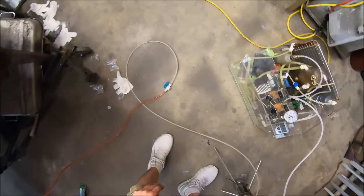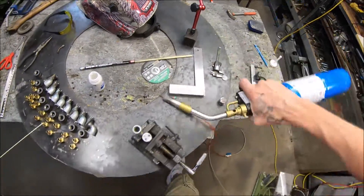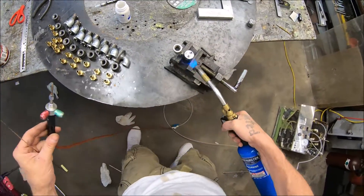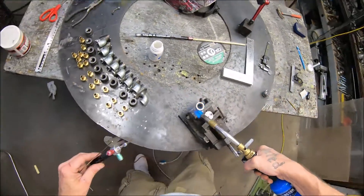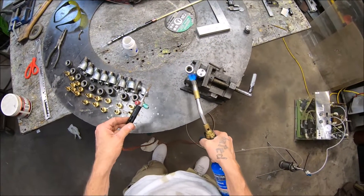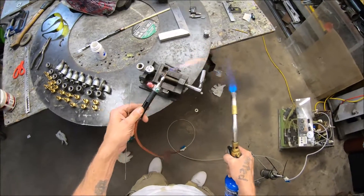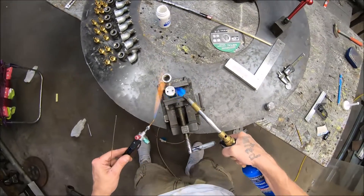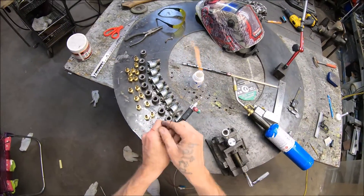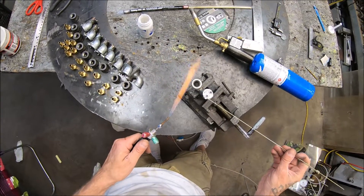I like to let that flow. I'm also going to preheat the base metal here with a propane torch — this thing's going to soak up a lot of heat. Crap, I don't have enough flux — bad timing. Oh, hell with it.